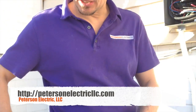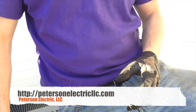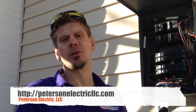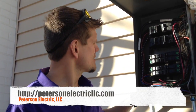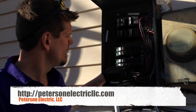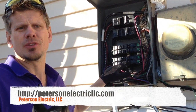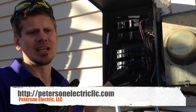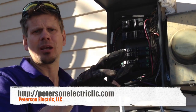The split bus main was a 50 amp on this, and this was actually independent of each other as well. Their theory is that if one leg breaks, we kill power to the second leg, which protects either energizing equipment or even the person looking at it. For instance, if you have a dishwasher and a disposal and you kill the dishwasher but leave the disposal — or you're trying to change your disposal while the dishwasher is running — that neutral is carrying current back on the other phase. If that's nine amps and the other circuit's off, you might get hit with nine amps just touching that neutral behind the disposal.